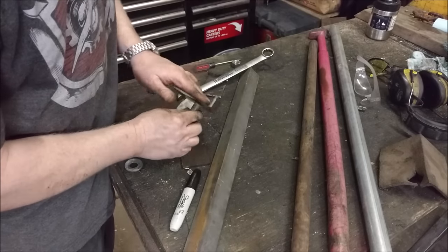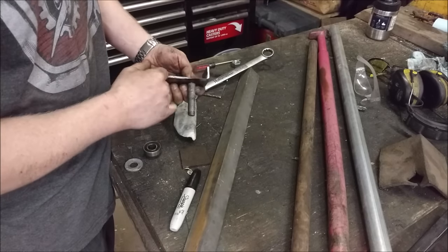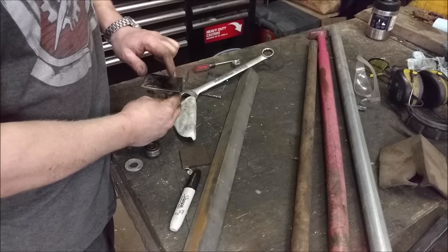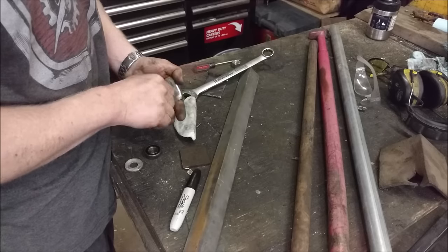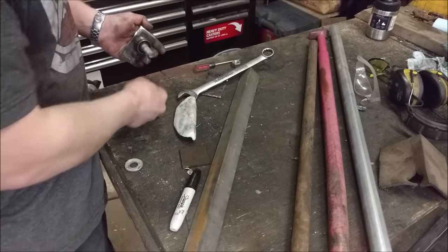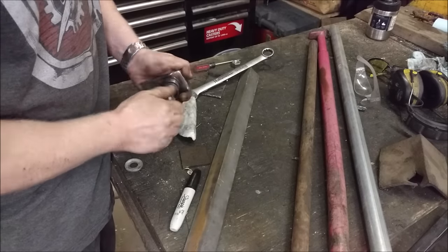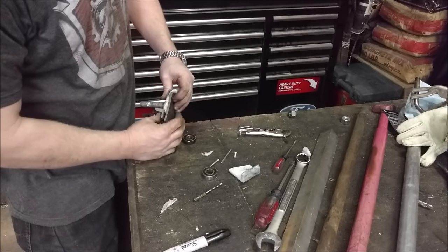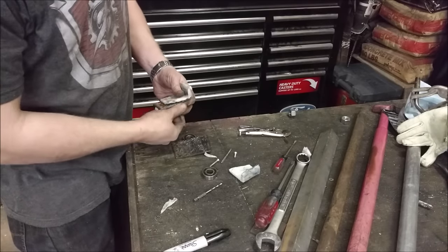So I've got that all welded on and just ground flat. Ideally I'd want to weld on this side too but I don't want to protrude into the bearing area, so I chamfered it and welded as deep as I could, which should be good. And then one bearing, two bearings, and then we can put on — we actually don't even need a washer, or we can put this nut. So I heated this plastic up some more and then sandwiched it in between another piece of steel and just vice-gripped it, and as it oozed out I just kind of molded it around.